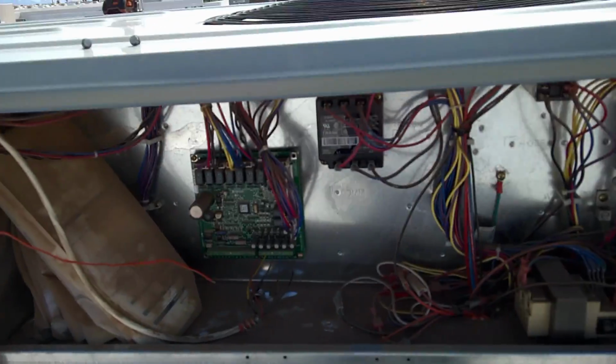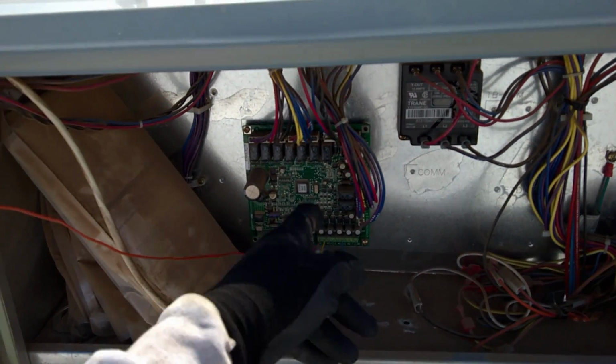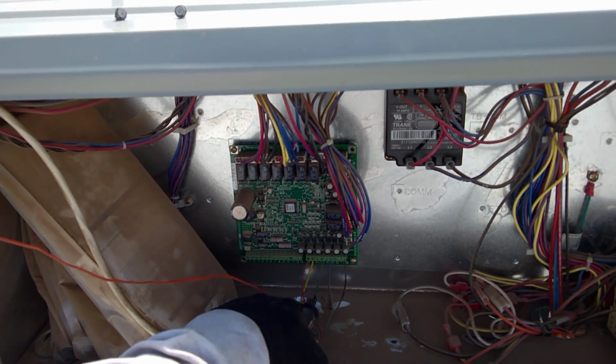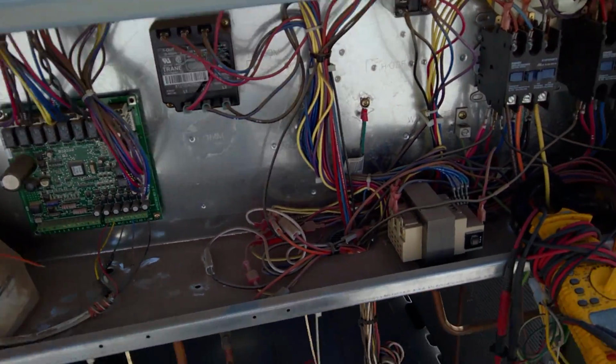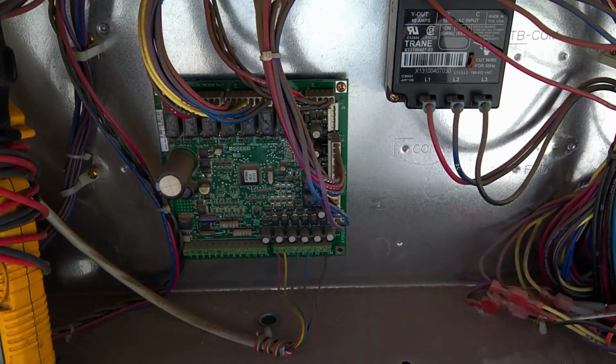So it's high tech in the supply, with an electronic drive. Of course, this is pretty standard for what they've been doing. It does have a built-in 3-phase monitor for the compressors. Reliatel board. This one's got the connections for a standard thermostat, because they have their own EMS here. Of course, you could use the test mode, which I'll be doing. So I'm going to fire up that blower and put this unit in test mode.